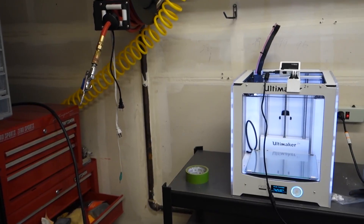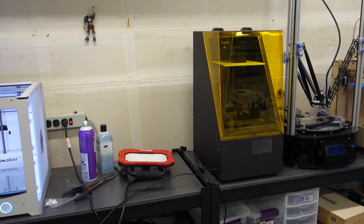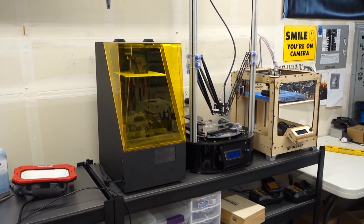I have a highly dusty environment that I use my 3D printers in, which is my garage. Now if you're in a hermetically sealed room, this filter really doesn't make a whole lot of sense. But if you're in an area where dust is an issue, you absolutely want to use a filament filter, because if you don't, you end up with a lot of drink coasters and rings.